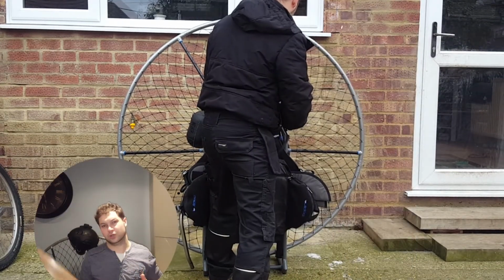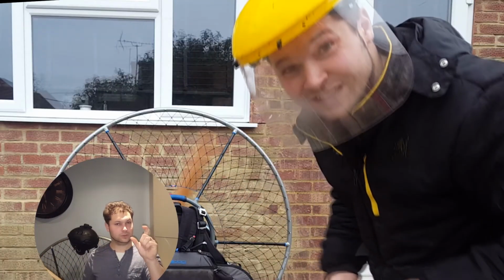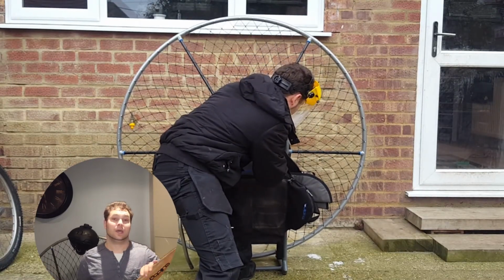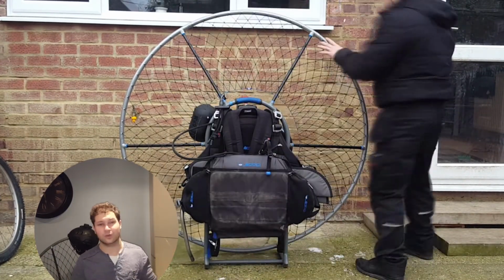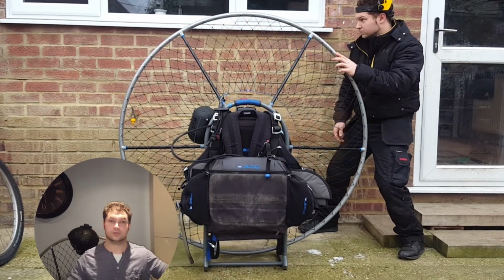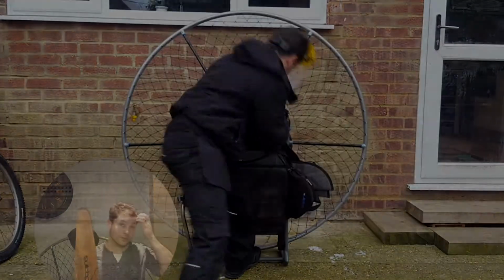This video was just to show that if you're down on your luck, down the field, you're falling over, you have a little tiny tube of super glue, a little packet of bicarbonate of soda, and the smallest amount of 40 grit, you could get this done. To be fair, if I was down the field, I wouldn't have dremeled that all out and everything else. I would have just split it, super glued it, stuck it back on, soda, and sanded down. That would have taken 45 minutes maximum, and it holds together better than the wood itself.